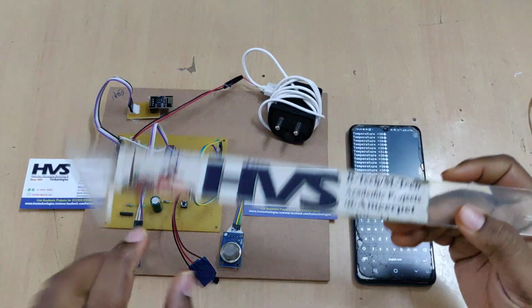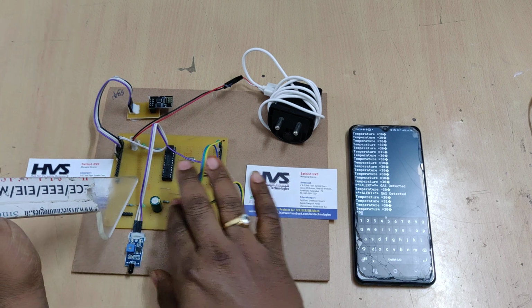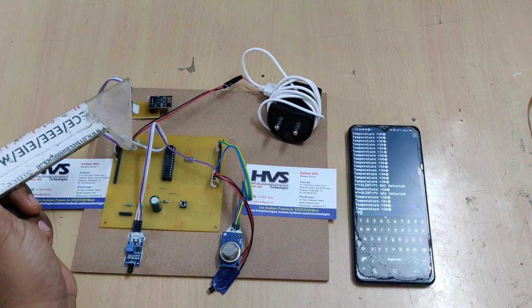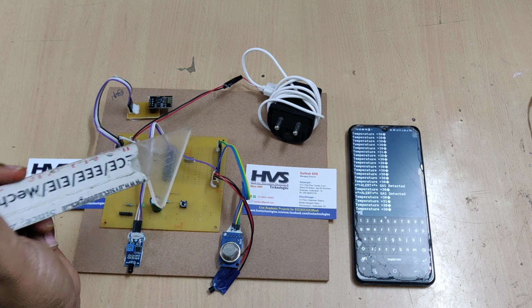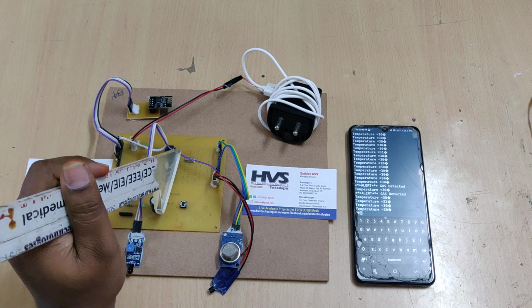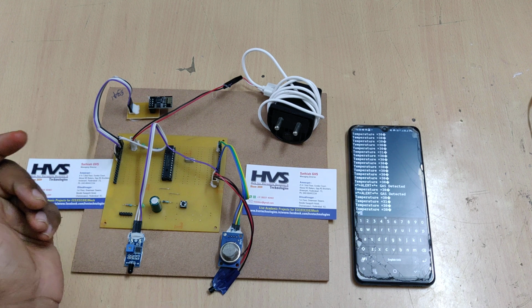Next, on this motherboard we have three major important components. One is our microcontroller, which is interfacing between the inputs and controlling the outputs. Next, the steel plated one is the crystal oscillator, which provides 20 megahertz of oscillating frequency to the controller. The main purpose of this crystal oscillator is that we have provided the set of instructions in embedded C language to the microcontroller.